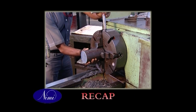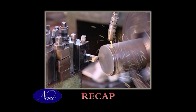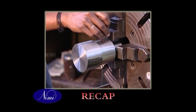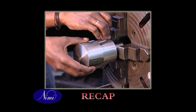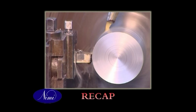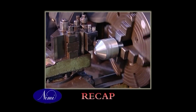Set the job in a 4-jaw chuck. Face and turn. Reverse and turn to the total length. Face and finish to the size. Knurl on dia 70.